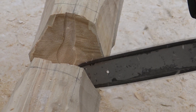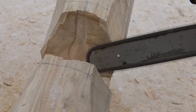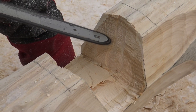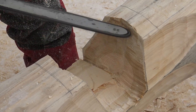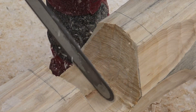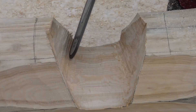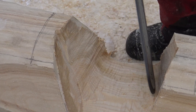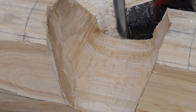Next we need to do some finishing work. The chainsaw bar, and especially the lower tip, can be used for this work. The whole idea here is to make the inner parts of the notch somewhat concave — this space is needed for the insulation. The upper part of the notch has to be even more concave. Also, the edges here have to be quite steep and even slightly weak; when the log settles, these kind of weak edges don't prevent settling.